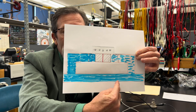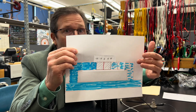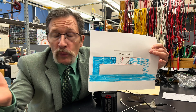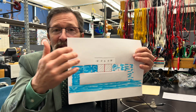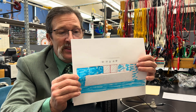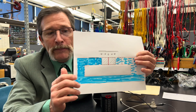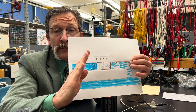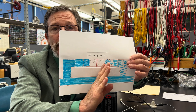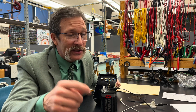Notice the water can flow through here, but it can also travel up and push on this side, and on the other side the water can push on that side. In a tube of water — like one of your pipes at home — there's not going to be any difference, and that's really what a voltmeter does: it tells us a voltage difference. However, if I had an obstruction or some resistance in that pipe, we'd end up with more water pressure on one side and less on the other, and that red line would move. Voltmeters should be connected in parallel, not series — that's our problem.